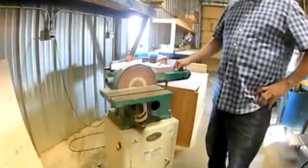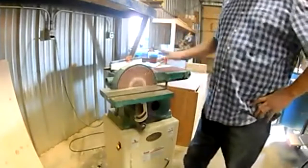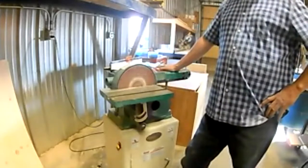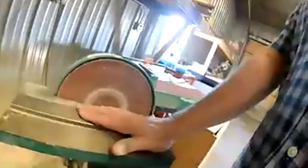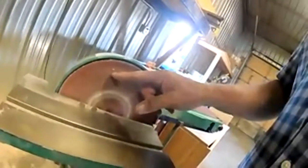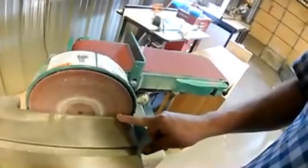Keep in mind that when you turn on the switch, you're turning on both the disc and the belt at the same time. If you're using the disc sander, the belt surface is not a work table — don't put things on it. On the disc sander there's an on/off switch, an adhesive-backed disc, and a table that's almost always set at 90 degrees to the disc. Always keep the clearance between the table and disc less than an eighth of an inch.